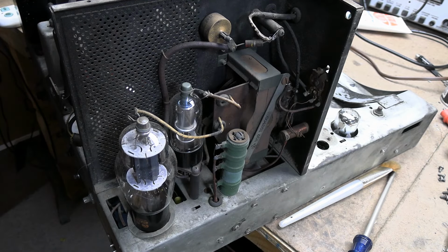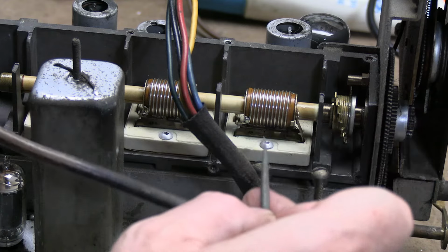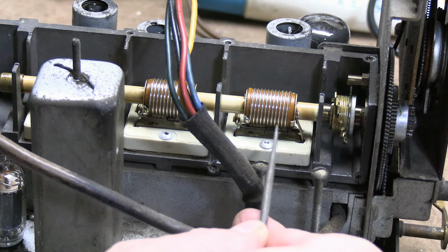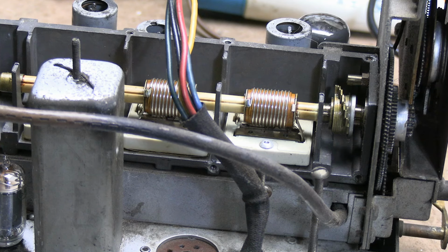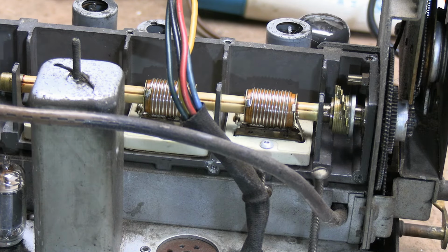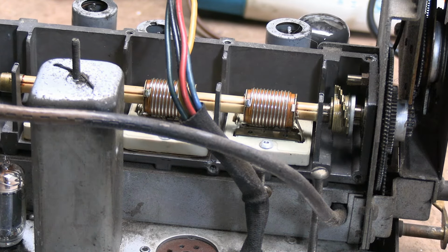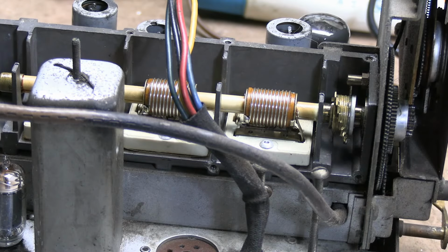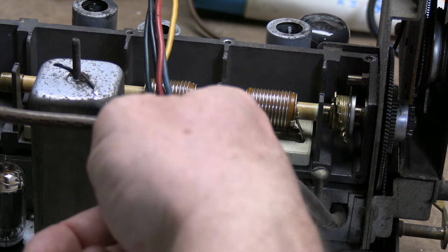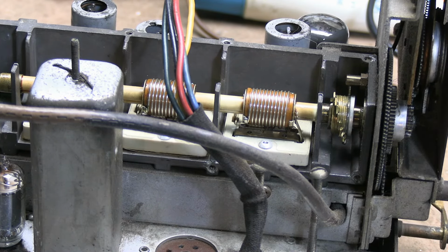It makes some sense. There's a much more troubling issue on the other side of the set. Alright, so down on each one of these coils is a little contact that slides back and forth as I rotate this. Hope you guys can see that. Try to get a little more light down in there. It's hard to see, but right now it's two turns over from the right, and all three coils are in exactly the same position. But that's as low as it'll go, right there. We've still got another turn and a half, two turns more, it could go to the right. When it goes to the other extreme of the dial, it goes almost all the way to the very end. It's like the whole thing needs to be shifted over one loop, one turn on those coils. I don't know how to make that happen.